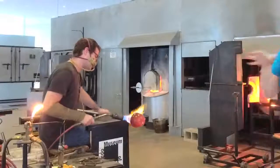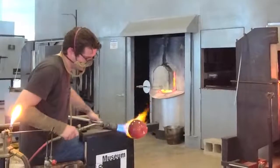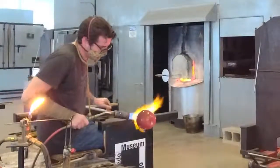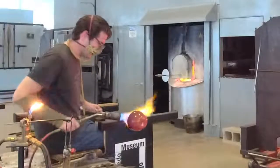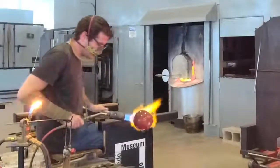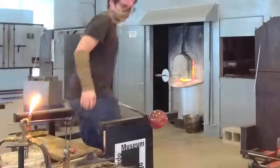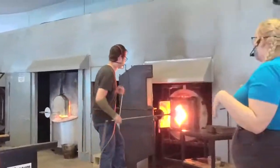Since we've just gotten that bottom so hot, we want to really even out the heat in the piece before we do our hot sculpting. So we're just getting a nice torch on the top. If we were to just go into that reheating chamber over and over, that bottom is going to stay hot. The first thing that goes inside the reheating chamber is usually the last thing that comes out. Now we can really see what that heat looks like — but it still looks brown.